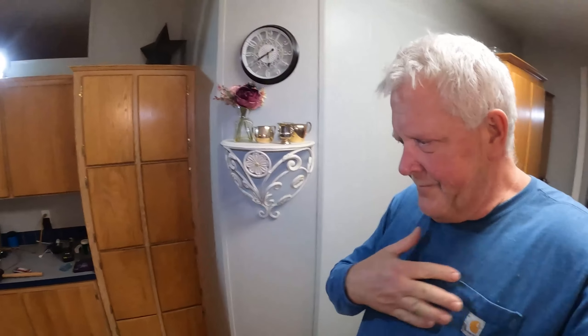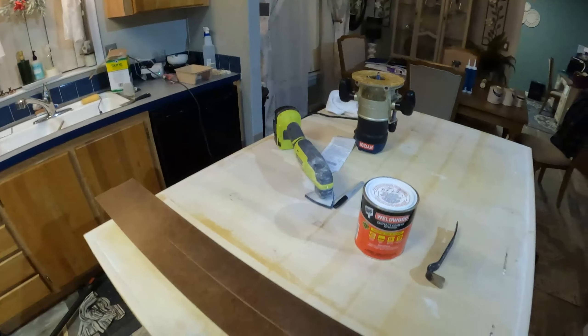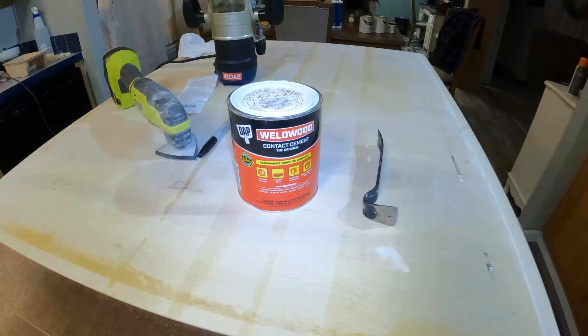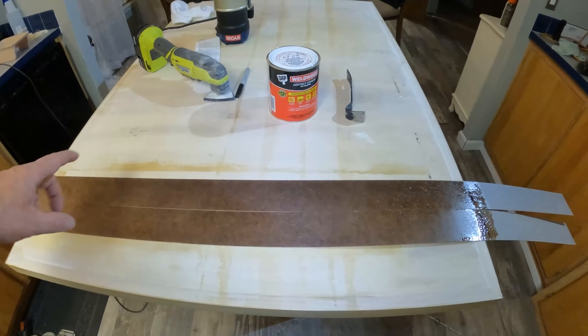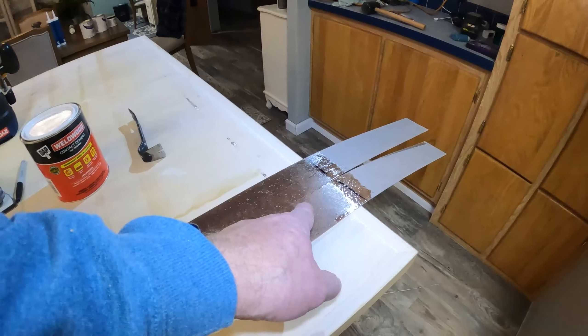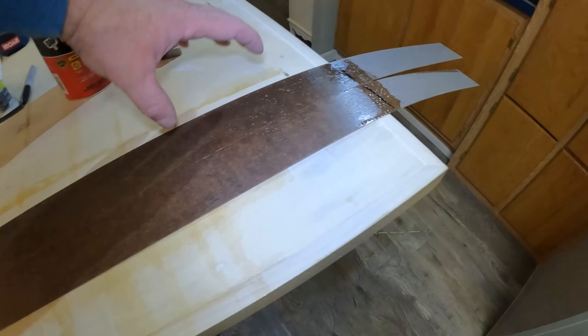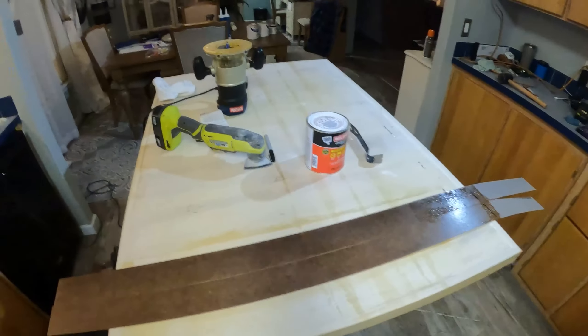We're going to put on our edges — already got the two long sides on, and now we're going to put on the new side. What you do is take the contact cement and basically paint both strips and both ends. You wait until it dries to the touch, then you stick them on there and roll it. You can see it's dry right there — this one's pretty dry, a little wet right here yet. We just gotta wait for that to dry, then we'll stick it on and route it.